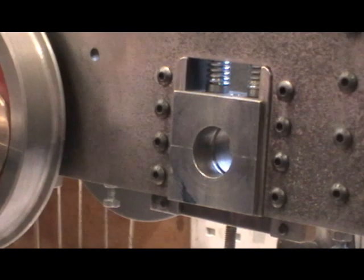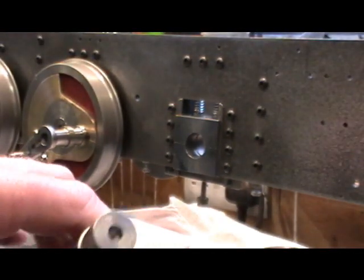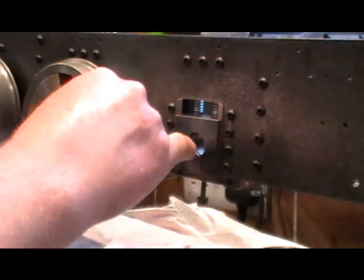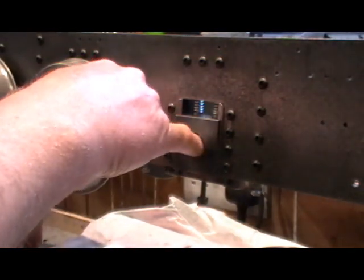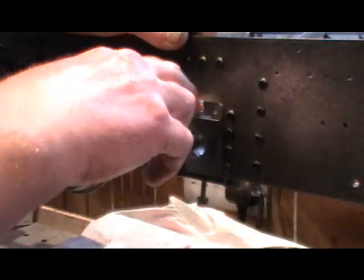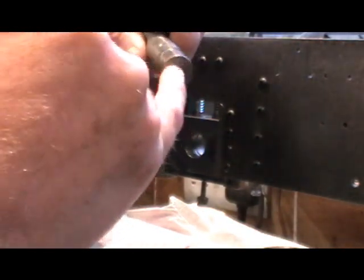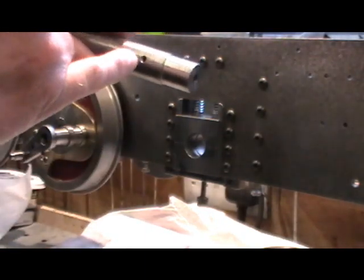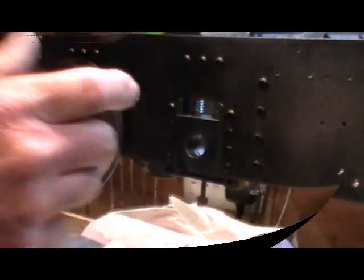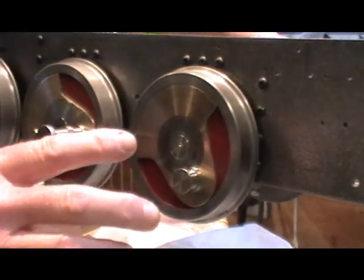It's pretty basic really. I've drilled up the axle on each end with a 1/8" hole, the same size as the groove in the axle box. Then I measured from the end of the axle to determine the center of the axle box exactly, and drilled a hole up the axle on each side. Then I drilled a cross hole into that hole exactly in the position where the groove is.